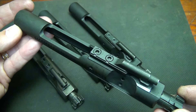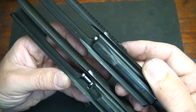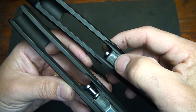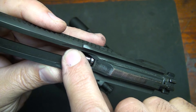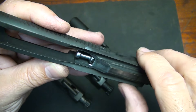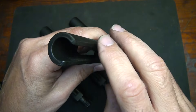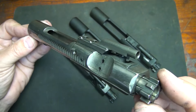These work just fine if it's working in your rifle, but one thing I don't like about this bolt is that the firing pin is exposed. On a standard AR-15 or M16 there is a protective shroud where the hammer rides against the bolt carrier. With the half-circle design, the hammer can hit the firing pin and ride it down before it hits the bolt carrier, causing wear — I've even seen pins bend and break. That's why I'm not a big fan of the half-circle bolt carrier.